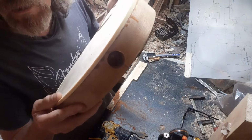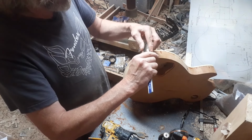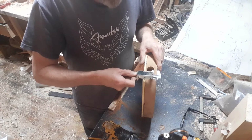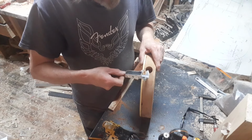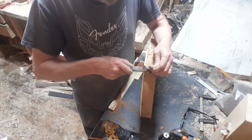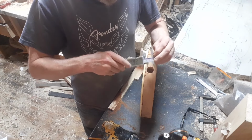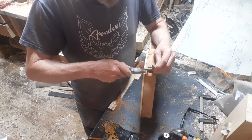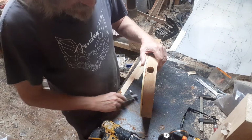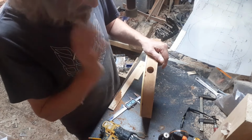So we've got our hole drilled now where it should be. If we measure down, let's zero this. So we're 11.4 millimeters from the bottom of the body there, and 11.43 millimeters at the top, and we've ended up with a hole that's a bit bigger, which you tend to. Yeah, we're 26.06 millimeters wide on that, which is hardly surprising with those spade things. They wobble a little bit, but like I say, the original was not a thing of beauty at all. It's just a complete hack job.